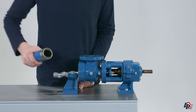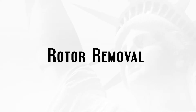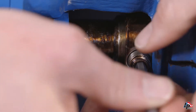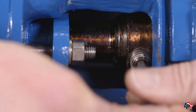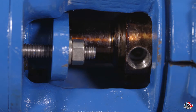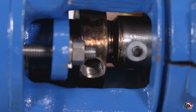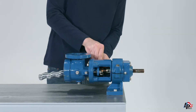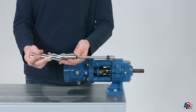Rotor Removal: The pump rotor is removed from the pump together with the connecting rod. To remove the connecting rod from the drive shaft, remove the drive pin retaining screws using a 1/4 inch Allen wrench. Slide the collar pin retainer forward towards the packing gland to expose the drive pin and drive pin washers. Remove the drive pin using a punch that is the diameter of the pin or smaller, driving the pin out with a hammer. The drive pin washers can be easily removed using the same punch. Remove the rotor and connecting rod assembly by pulling the connecting rod out of the pump drive shaft.